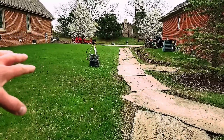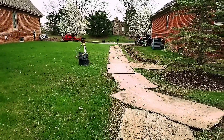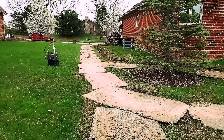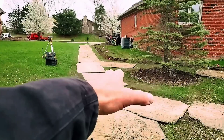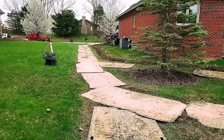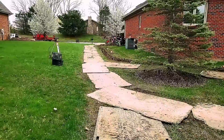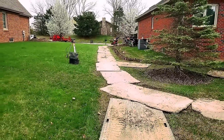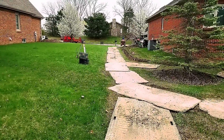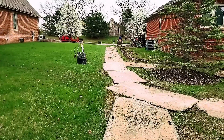The reason why the side of the house is so wet is the neighbor's grade is higher, so the water is shed to the swale. The swale is closer to the homeowner we're working for. When water is left to lie in turf grass, it can't find its way out. It's not like a cement or asphalt surface where water sheds with one percent slope really easily. One percent slope is the absolute minimum developers are allowed, so everything built in the last 45 years has one percent slope. The problem is turf grass needs five percent slope to get the water out of it — and that's not a reality. So that's why French drains are so common.